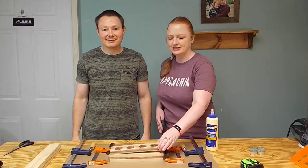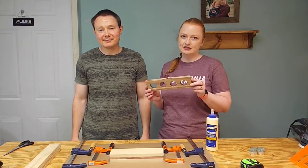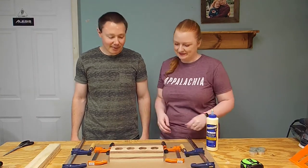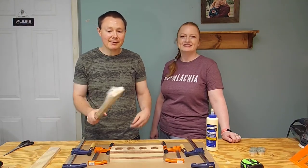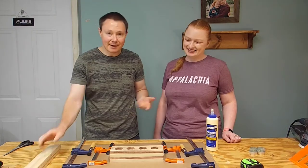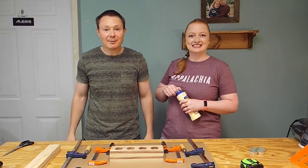As you can see, we now have our four holes drilled for our four tea lights, and we've checked them, did a little test run, and they fit really nicely. Now it is time to assemble. We're going to be doing that with some Titebond II. We've got some cauls here — just pieces of plywood wrapped in plastic wrap to keep glue from gluing wood to wood. And we'll be holding it all together with some F-style clamps.